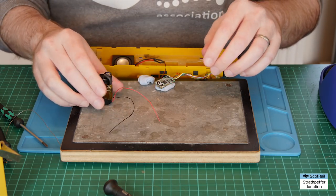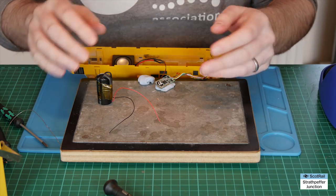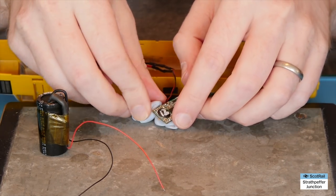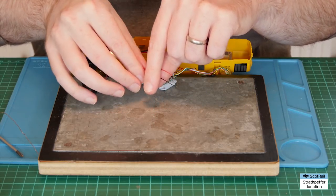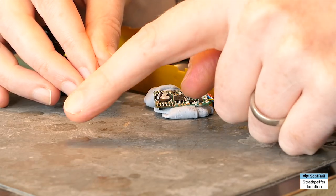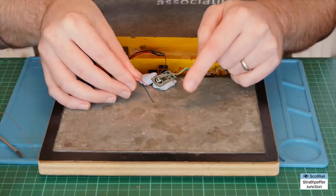The other thing that's vital for this fine soldering is something to hold everything in place. Some people like those helping hands with crocodile clips — I use them for some things — but for this really fine soldering onto decoders, what I find works best is a little bit of blu-tack in the right position. That holds both the chip and the wire in exactly the right position. As long as you don't apply too much heat directly to the blu-tack, it doesn't melt but it holds everything where you want it. Also strip back the two wires from the stay alive unit and pre-tin them — I've stripped them back about one millimeter and pre-tinned them, which makes everything so much easier.